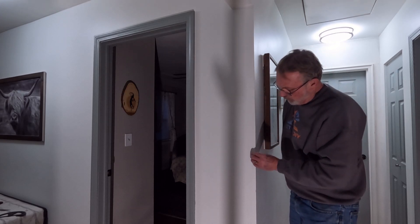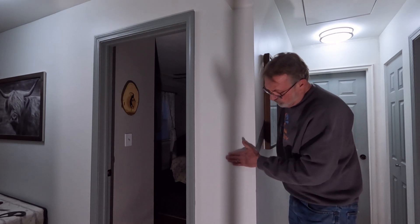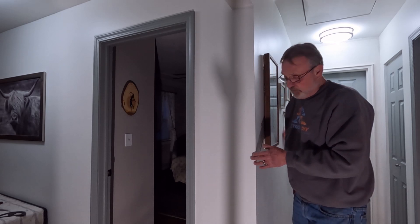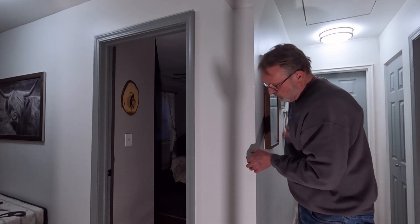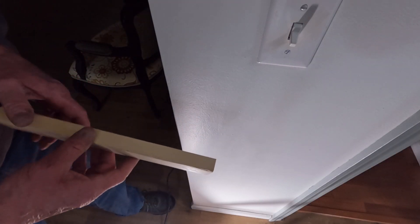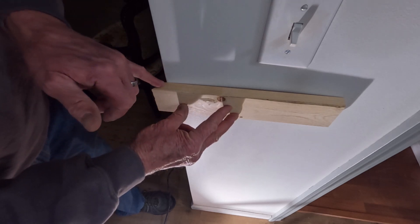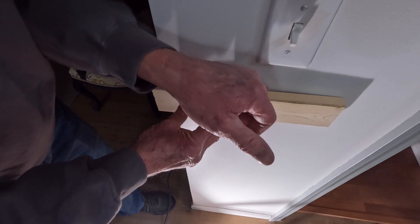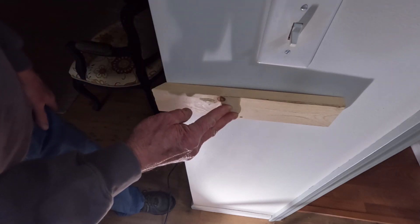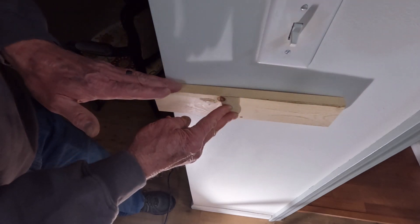When the drywall is finished, they put a corner molding right here and the corner molding stands proud of the drywall. Then they put their finish compound — their joint compound — on here to finish the wall. The wall looks flat, the wall feels flat, but is it flat? Let's take a close look with this board that I've got cut as a straight edge. As you can see, I'm touching here and I'm touching here, but I have probably an eighth or three-sixteenths of an inch gap right here. So even when we're using our T-bevel, we could be getting a wrong reading because the blade just isn't long enough to span the full width of the wall.